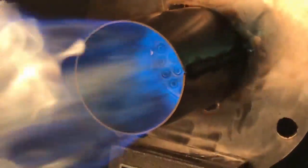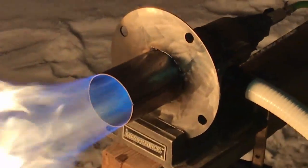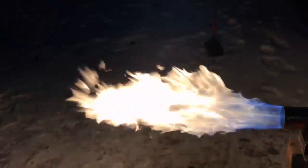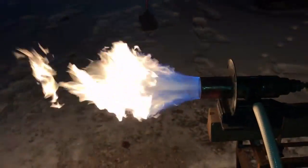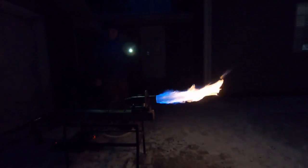You can see that's just a real nice burn inside of there. We're getting a real good mix. The complexity of this nozzle was kind of going for that feature — without that complexity you don't get as good of a mixing. I felt this was probably the best way to apply a low-pressure gas to what may be a higher-pressure blower air. We don't want the blower air messing up the gas flow, so this nozzle actually pulls a vacuum on that gas line rather than affecting the amount of gas that could come out.